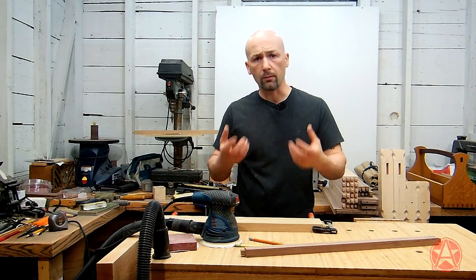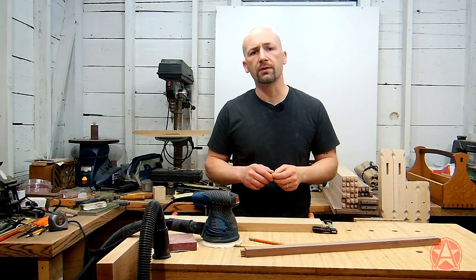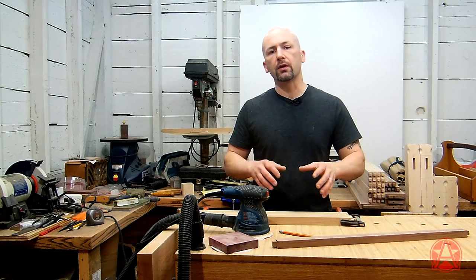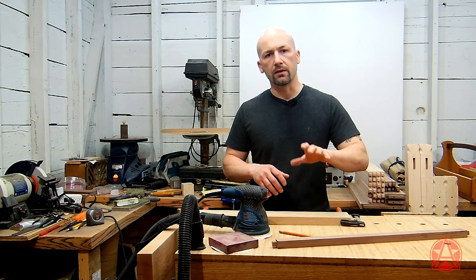The oak is a little harder — it took a lot more work to get to the same point I did with one pass with the walnut. By clamping these boards together, I've kept the sander from tilting and causing an uneven edge. But this is where the grid mark really comes in handy on small parts.